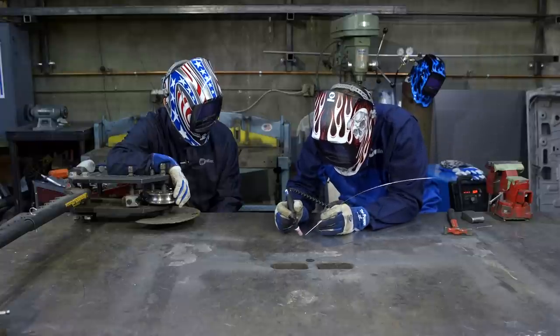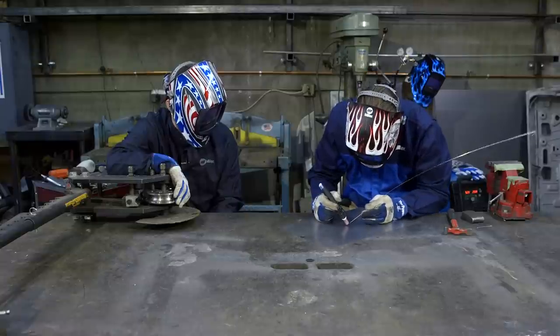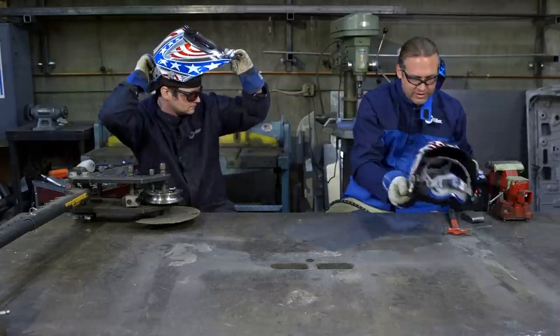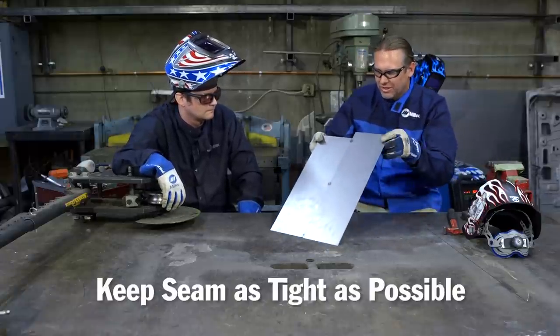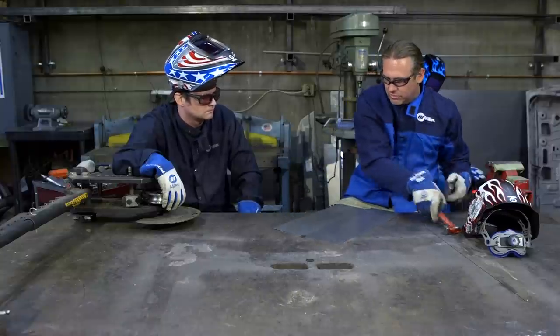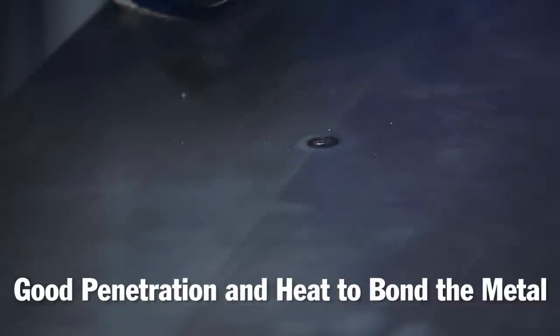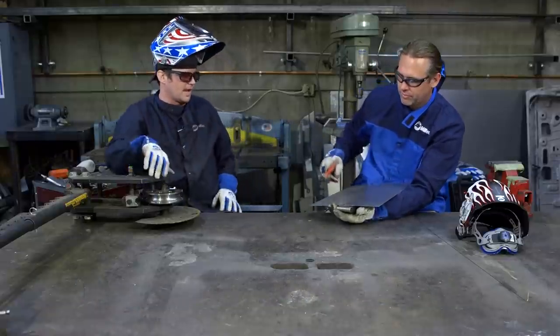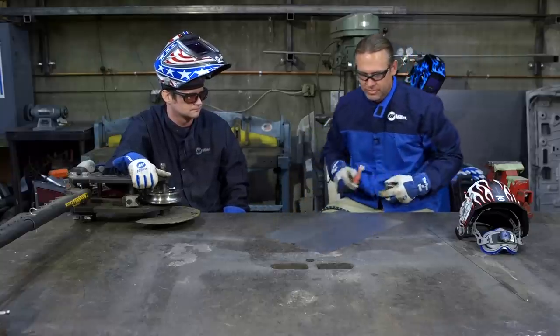So I'll go ahead and do a little tack here to get started. There — as you can see, it's left a nice tight seam because you want your seam as tight as possible. It really didn't move much, though I can see it did a little in the middle. I'll just grab my hammer and kind of flatten the weld. You can see how it flattens it out? I got good penetration and good heat — the weld went through and it's going to really bond the two pieces. Then I'll just do the same thing down the line.